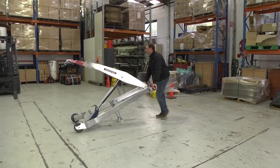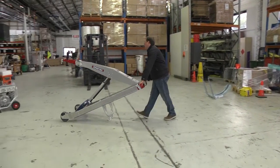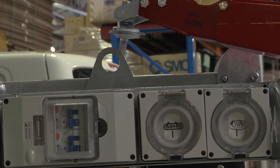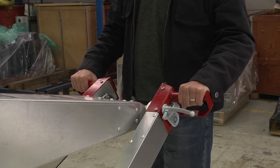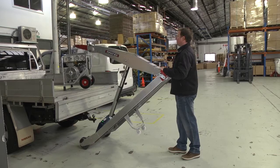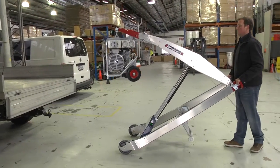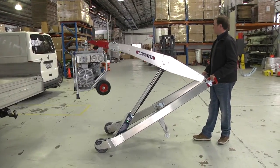It is important to plan your execution, that is, ensuring the PHT has room to roll up to the lifting point and the hook can come close to the lifting point without lifting the hands up too high. So approach the machine where possible on the side where the lifting point is closest to the edge of the equipment. Picking an object off the ground.